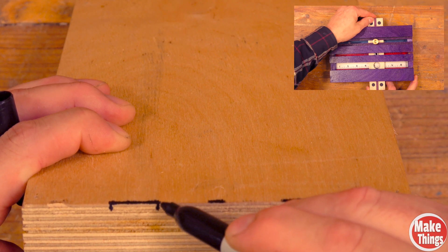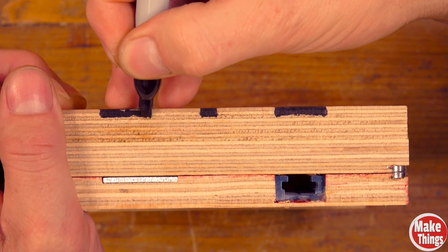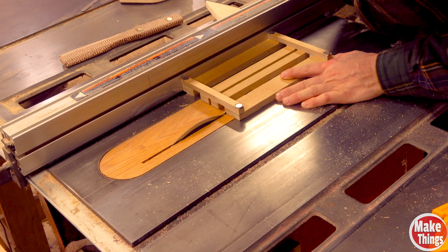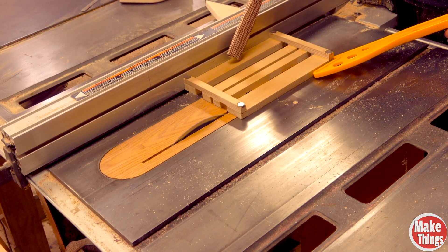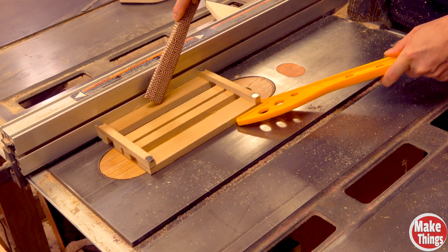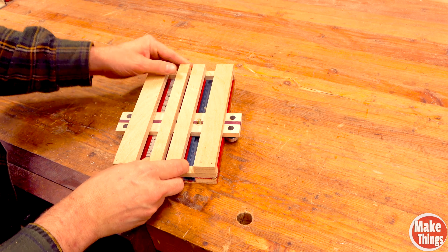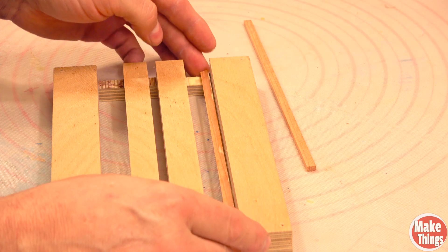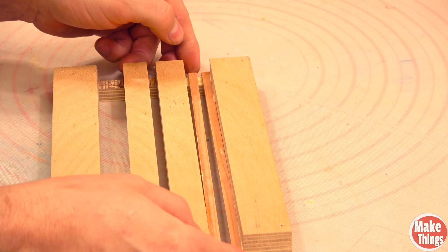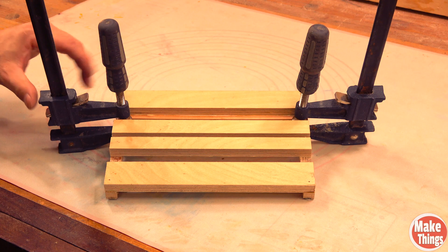The jig will have three different pockets on the top that will allow me to see the measuring position, attach the pin, and lock the jig down to the T-track. To cut each of the pockets out, I used the table saw — this is a great way to make sure all my cuts are parallel. I attached it to see if everything was lined up. Next, I glued a couple of thin strips to one of the inside tracks. This will be important as it will allow me to lock the jig to the T-track with a thumb knob.